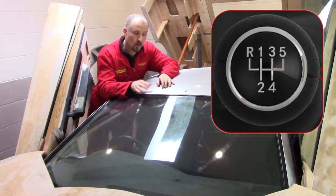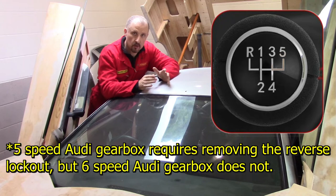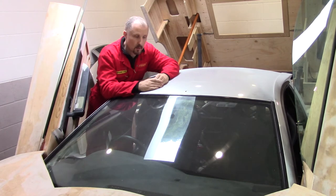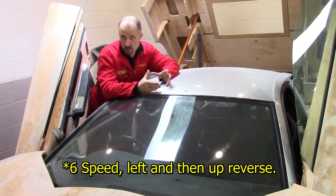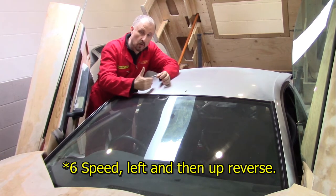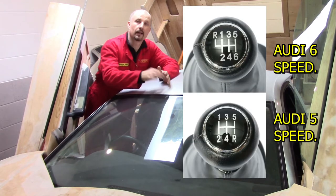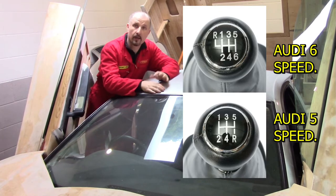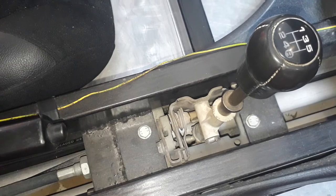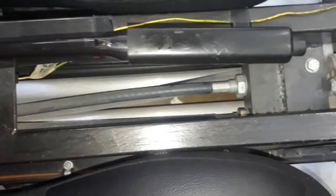The Golf Mark III lever does work quite well in this application, although I would have preferred not to have to cut the reverse lockout from the gear lever. If any of you out there know of a small compact gear change which is preferably made from steel and has the reverse lockout in the same location as the Audi, let me know in a comment below and I will research it and may use it in the turbo build. If you take a look at the gear change you'll see that the adjusters are inside the car so they're quite easy to get to. We'll also take a look at the handbrake.